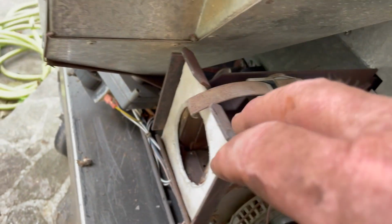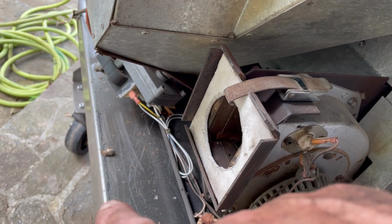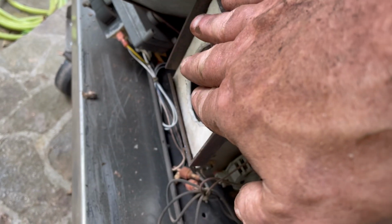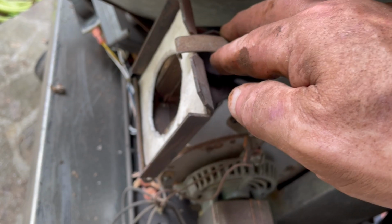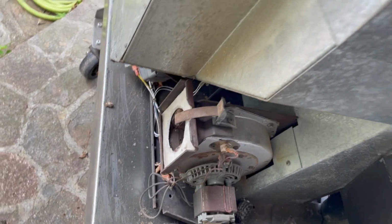And this combustion blower connects to the chimney flue in a really interesting way. The T has a metal plate on it that slides into this slot and then flat pushes up against here, and then this buckle comes over to the top and pulls it in and locks it tight in place, so that all I have to do to take it off is to flip this buckle and lift it out. It's a nice system. These stoves are Canada's premier stove. I'm in Maine, but they are made in Vancouver, and there are several models of them. This particular model isn't made anymore, but they're pretty nice.